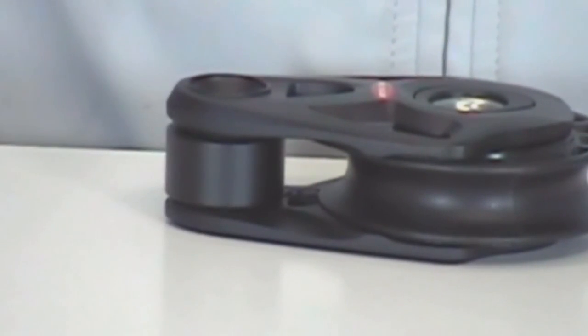The cheek scalloping allows for small discrepancies in line lead. The mast base block is specifically designed to fit a 14mm 9/16 mast collar post, and is highly efficient in its use of space around the mast base for tight nesting of blocks.